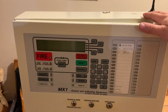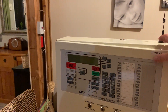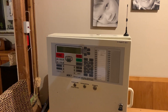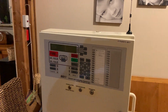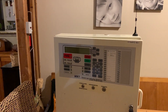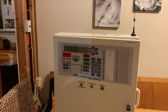This was in operation in my shed for about a year - it was doing linear heat, manual call point, and a smoke detector. The reason I decided to pull it out was because after doing the course I realized something very quickly: this panel has a very steep learning curve when it comes to user logic. So I figured it was best to pull this panel out and configure it as a test panel so I can keep my knowledge up on the user logic and how to program the panel, because if I don't use the knowledge I've gained from this course I will most definitely lose it.